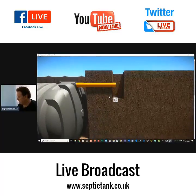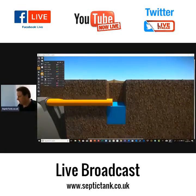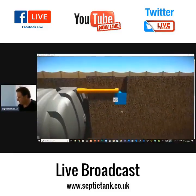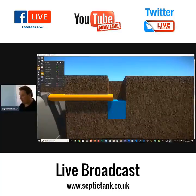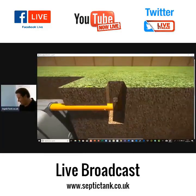Building regs state we now need to fill the hole with water. Fill the 300 millimetre square section of the hole to a depth of at least 300 millimetres with water, and then allow it to seep away overnight. There it is — it's seeped away overnight, and the hole is nice and empty again.